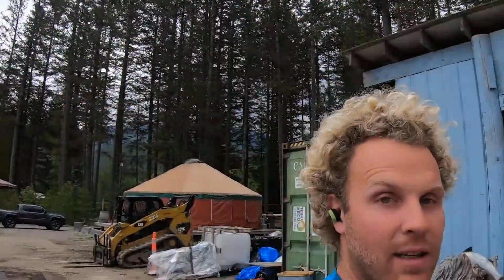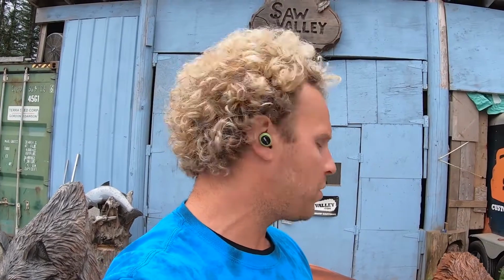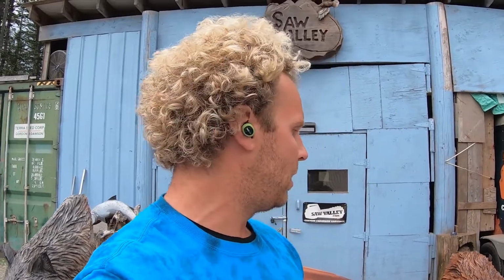To be honest, I'm happy with how it turned out. And you know, when you run into problems with cracks, you can always fix them. Not all the time, but most of the time you can fix a lot of stuff. So, you know, you cut the wedge, you fill it, you use wood filler, and then you carve it like it was never there.